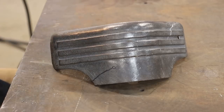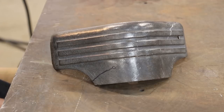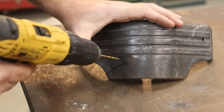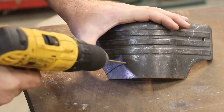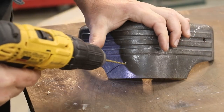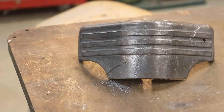And then we braze it all up. Of course, we'll fill that hole in either with braze or he can do it with some filling material later on if he wants to, to get it smooth for repainting. But the main thing is we don't want that crack to just be inside that braze, because it can actually continue on — once that fracture starts, it wants to continue. I'm going to use a hand drill here. This is so awkward to try to set up on the drill press, and the precision of this isn't that critical. There we go — that's just a little eighth-inch hole through there.